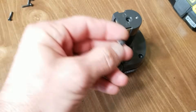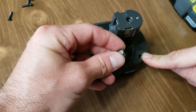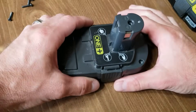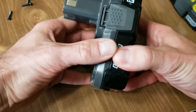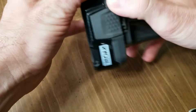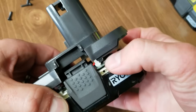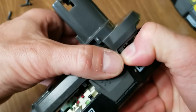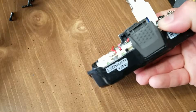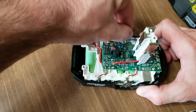If you are under warranty, you might as well get a new battery — keep that in mind before you do anything. From there, just gently rock things back and forth to pry the top from the bottom. Once you get a little bit of space, put your finger and thumb where I'm pointing and hold the battery down while you pull off the top portion, because the tower wants to come with it. It's got a good friction fit and you don't want to break that plastic tower portion off.